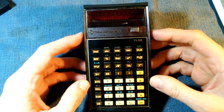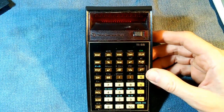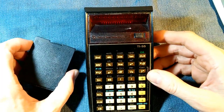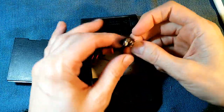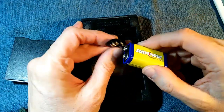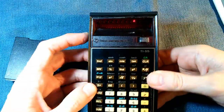In summary, if you have one of these venerable old TI-55 calculators and it's died because of a bad battery pack with no way of running it, you can solder in a 9-volt battery socket, plug in a 9-volt battery, and get it running just as if it were a TI-30. And you'll be back in business.